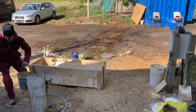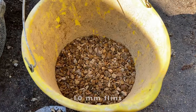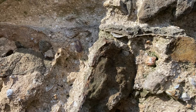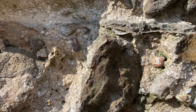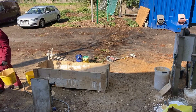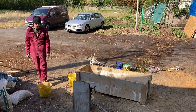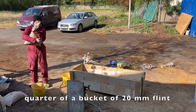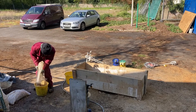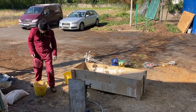Porous particulates is the word. A 10mm flint — again to replicate what we found in the original and to make our mortar as compatible with the original as possible. This is the angular flint; it's not pea shingle. What we find is that the stones in the walls are quite angular. A quarter of a bucket of 20mm flint — again, this is based on what we've observed.